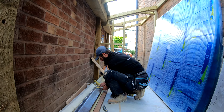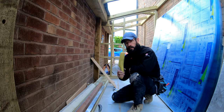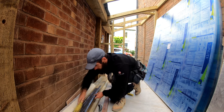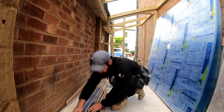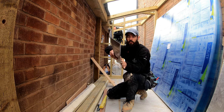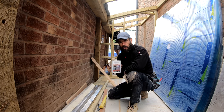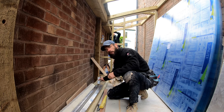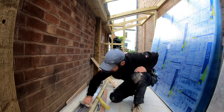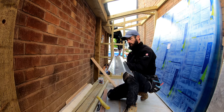Now the next bit we've got to do is get it dropping down. And there we go — if you look at the angle of all that now, we've got a bit going into the coursework, we've got our upstand, we've got our cover coming down on the angle fillet, and then we've got our drop into the barrel. Now the next thing I'm going to do is put on some patination oil. We put this on all lead that we do. What this patination oil does — it not only cleans it and gives it a lovely shine, it also protects it from oxidization. And if you look — that is super sexy.